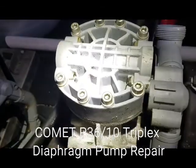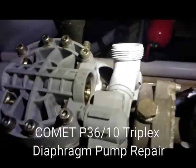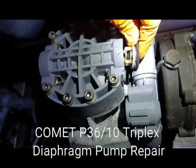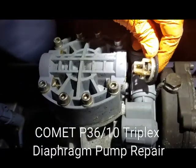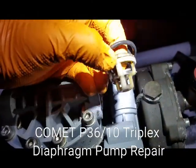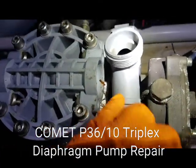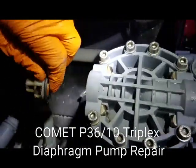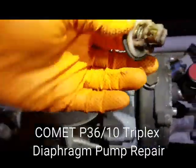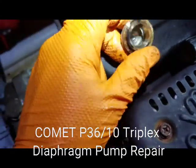Make sure your employees are set up to succeed in properly taking care of equipment. I've got this side out now. Something to note — by the pump's design you can actually see there's literally no spring in there, which is part of why we're having issues. You can actually see little pieces of springs right there that fell out. These need to go in this way on this side, and that way on the other side, just for the flow of liquid. We'll keep all these parts just in case.